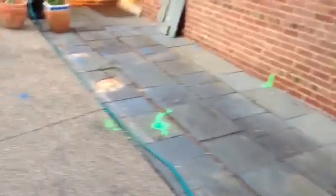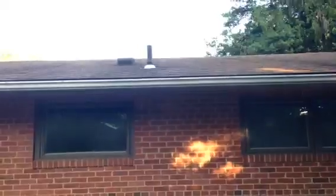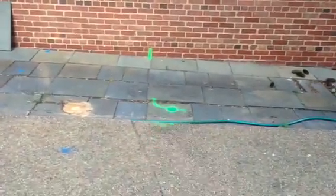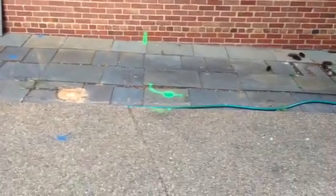The sewer line is right here, and then you're going to find the sewer again at another hole by the house — typical location, right there. As you can see, in line with the vent stack, you need to dig by the dot, right there. Again, ten feet deep.